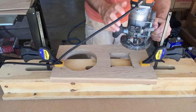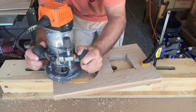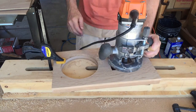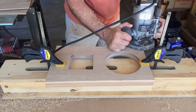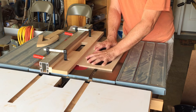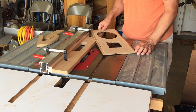With the piece stuck to the template using double-stick tape, I'm using a flush-trimming bit — this bit has a bearing on both top and bottom, and I'm using the bottom bearing since the template is on the bottom. It just cleans up the edges nicely. It did take a little chisel work on the area for the tile since I couldn't get into the corners with the router. After cleaning up the front piece, I went to the table saw with a dado stack and cut a couple of rabbets on the inside of the front piece — three-quarter inch wide to accommodate the side pieces.